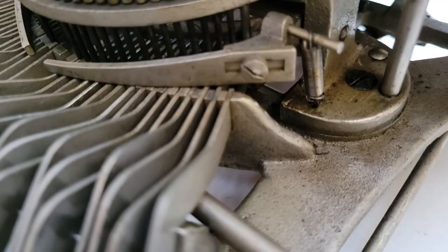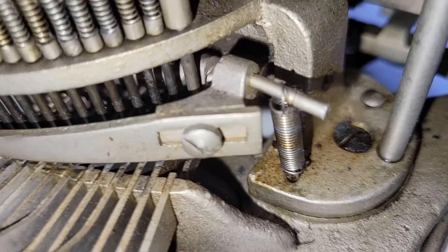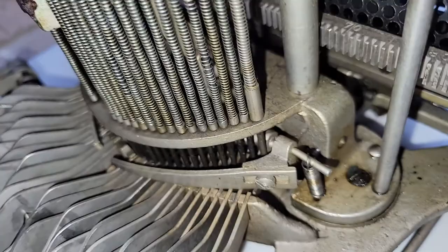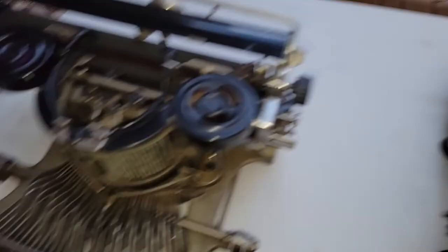It turned out that all I had to do was loosen the screw here, which allowed this pin to kind of move out a bit more and budge. I'm guessing the other problem was that that pin was engaging too deeply. Normally, as you can see, that pin is stationary, so it isn't contiguous with that middle piece — it would probably be like a spike that fits in. But loosening that screw helped it wiggle out to just the right amount of clearance. I still have some crud cutter in there, but after that wears out I will follow up with some Liquid Wrench.